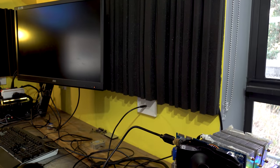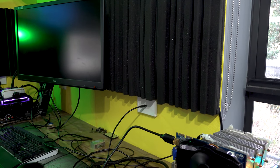That means you can do some further cleaning. You might want to dip it in water and just thoroughly clean the board. But in this case, the ASUS board just switched on and then switched off after 15 seconds. And it was just giving out no signs at all, even with the different DDR4 memory sticks. So the B150 was a no-go.